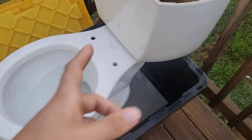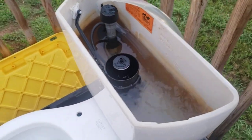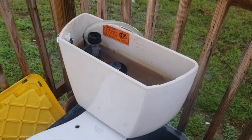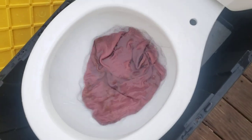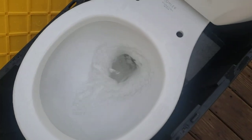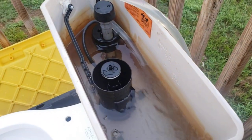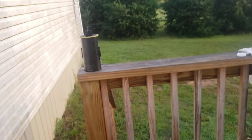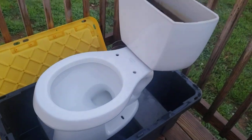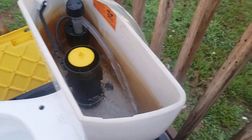With the way the Class 5 is designed, it's supposed to be what I refer to as a very high-flow toilet, meaning it's going to drain the water out of here very fast, and the aqua piston is supposed to help lessen the resistance compared to a standard flapper. I'll throw a rag in here just for shits and giggles — as you can see, a very short flush with this aqua piston, behaves like your typical aqua piston. I'm going to put the yellow one in here and you'll notice a good bit of a difference.